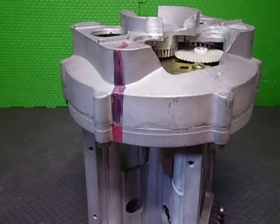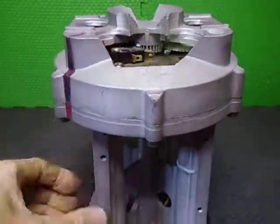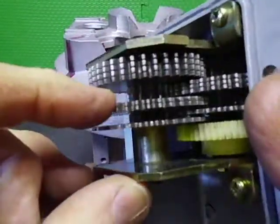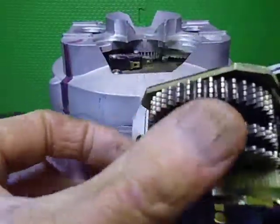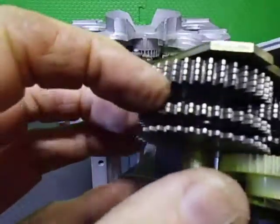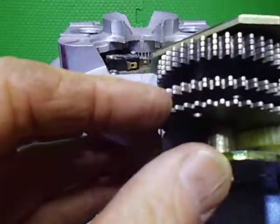They suffer a bit with wear because of the amount of moving parts. Especially these first gears here — the slower-moving ones inside — this one is actually quite badly worn. They're very sharp at the ends and have big grooves in them. The stamped-out outer gears seem to survive all right, but the centre gears are just a lower-grade metal and they wear out really easily.